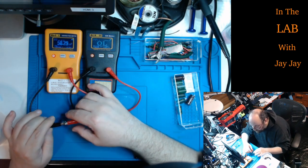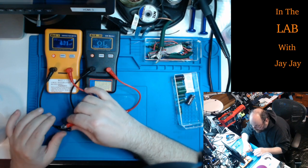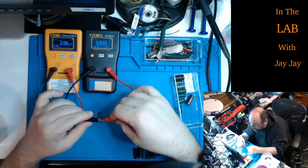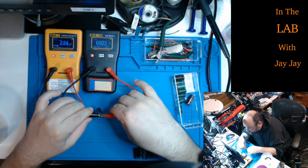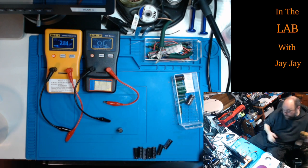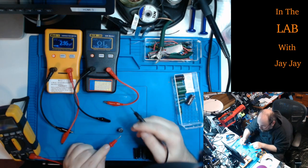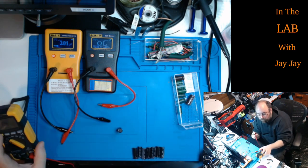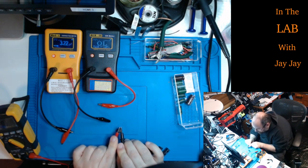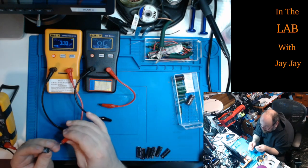This is the same type. Okay, it's reading 3.4 microfarads, which is way out, several orders of magnitude wrong. And let's see what its ESR is. ESR, very low. 0.022. Interesting. I wonder if this is short circuit as well. 0.02 ESR. So maybe. I've turned him off. Yep, not actually a short circuit. Okay, dead. So let's carry on.